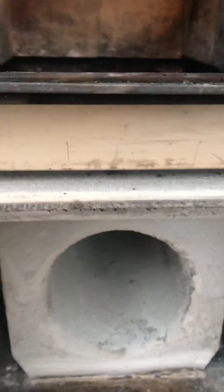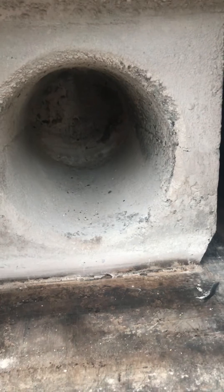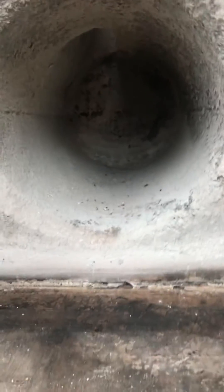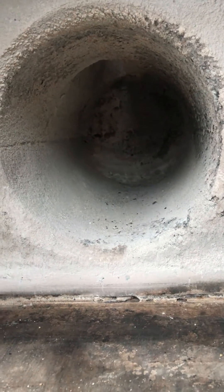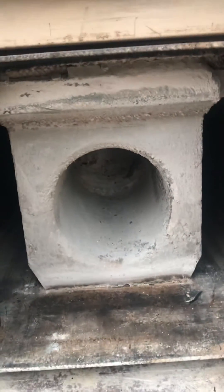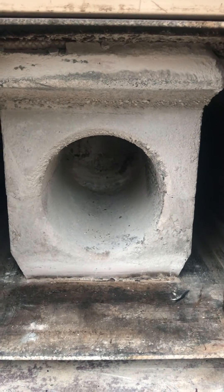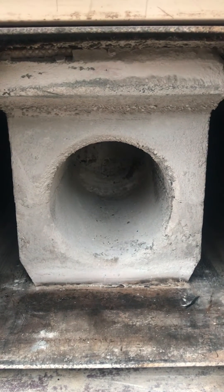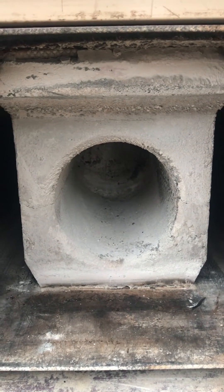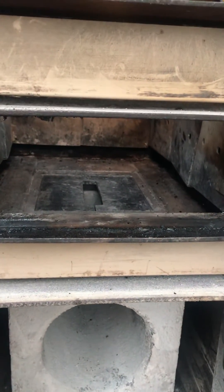Working down here to the vortex chamber — when the gas comes down here it's entering that back left corner and it's not hitting anything abrupt or flat. It's going in a nice smooth circle, a real nice transition all the way around, so you're not blasting a flat surface with all that secondary burnt gas. It's a real smooth clean transition, so you're not frying up refractory, you're not burning up nozzles — it's designed in such a way that these things are going to last.